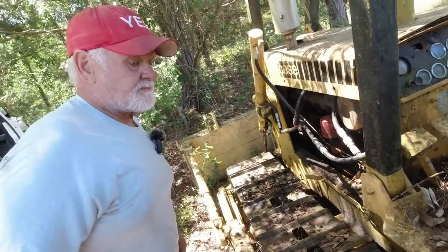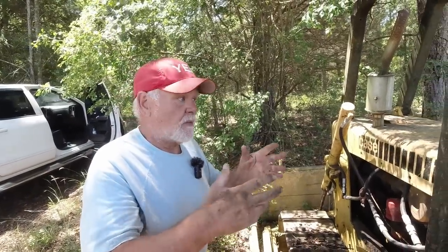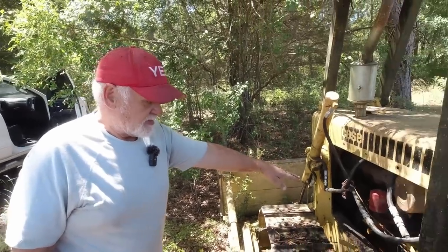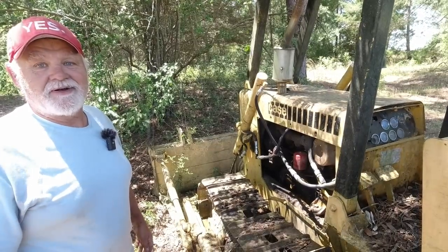All right, well, we can probably dig it where you can get under there a little bit better than I can. All I'm gonna do is break it loose and we'll get something to catch the water. We're not gonna take it all the way out because the water will start coming around those threads pretty quick. We just let it drain down till it gets oil, then we tighten it back up. This has not been started or ran or attempted to be started since the oil's like that, because the oil's not milky. So we're gonna send Jacob under there to get this done.